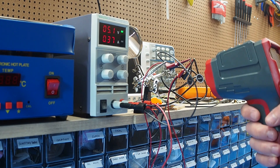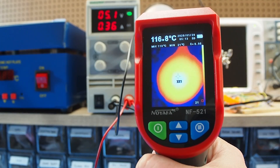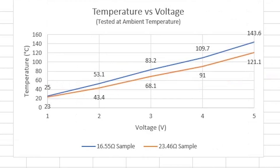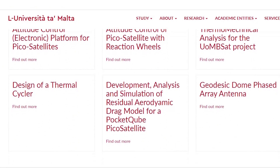The last thing I had to measure was the temperature. I heated both coils by powering them at different voltage levels and measured the temperature using a thermal camera, which allowed me to read the maximum heat point of the board. As expected, the temperature difference between the two samples kept increasing, which at 5 volts reached around 20 degrees Celsius. All these parameters and new variations are updated on the new datasheet revision. I'd like to thank the electronics department of the University of Malta for letting me use their X-ray inspection machine — when I was a student I had the privilege to work and study in their awesome lab. See you in the next video.